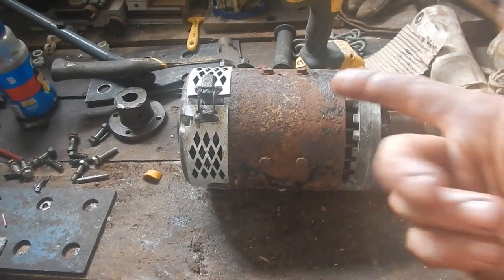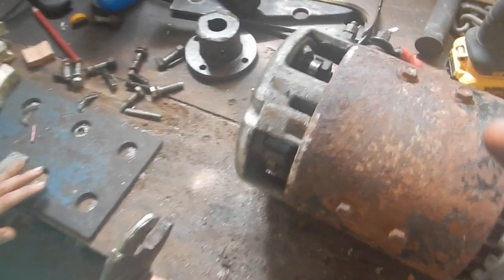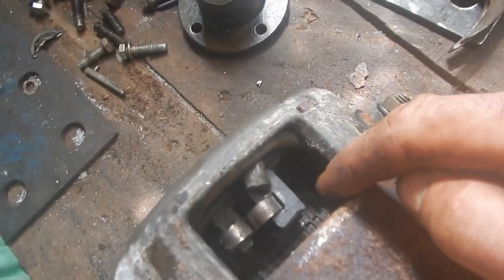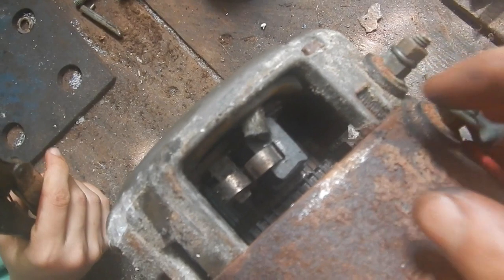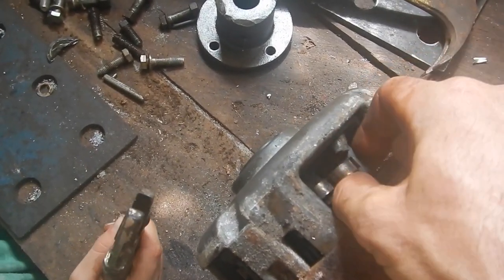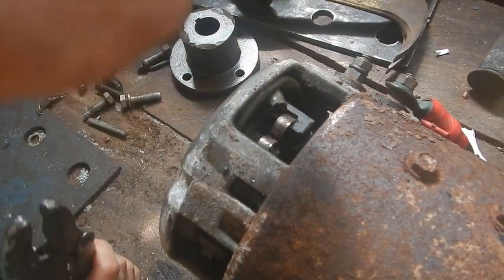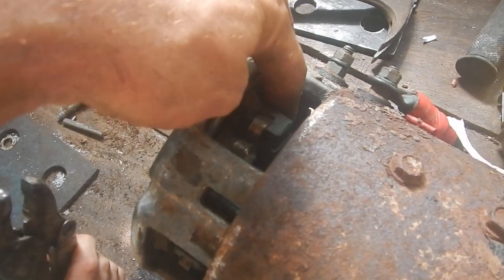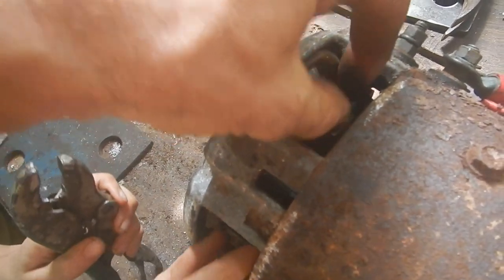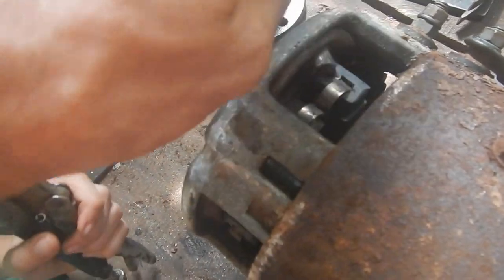I just need to make them work. It's basically two opposing electromagnets. That's all it really is. So this thing has four brushes — carbon blocks. The electricity goes through that into that part down there. We're just going to check that all of these move and they're loose enough. That one's got good contact. They should be spring-loaded, so they're pressed against the moving part with the spring. And if I can pull it back against the spring and it moves back easily and it stays pressed against the thing, it's probably okay.